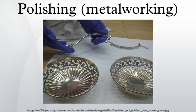The term chem-mechanical was coined to describe the action of corrosive slurry on silicon in a polishing process. Multiple rotating heads, each studded with silicon wafers, get forced against a large rotating buffing pad, which is bathed in corrosive slurry. Material removal at elevated temperature progresses first through oxidation, then through oxide removal by abrasion. This cycle repeats with each rotation of a head. Potassium hydroxide and silica can be combined with deionized water to form such a slurry.